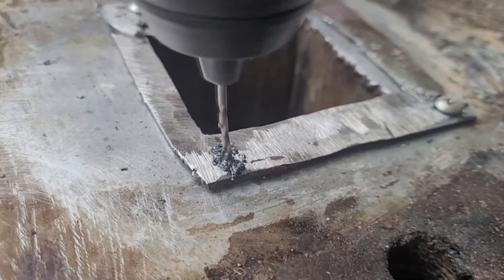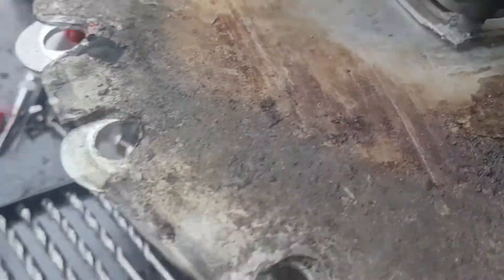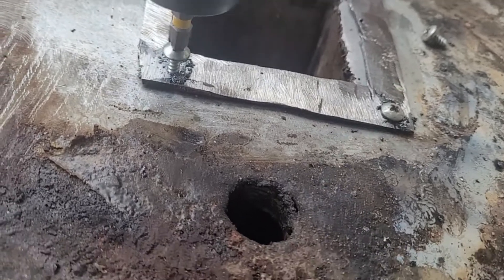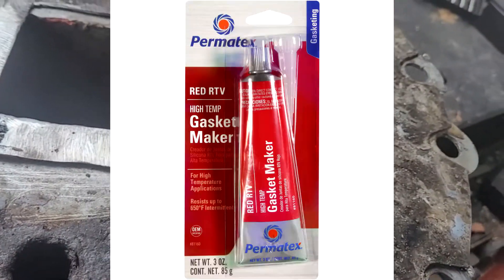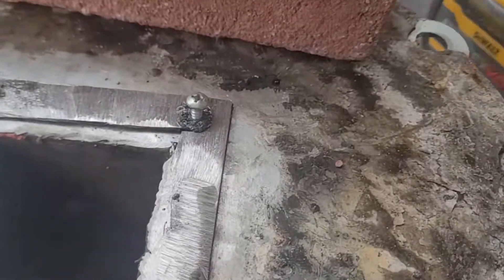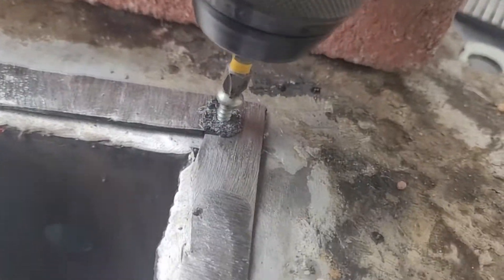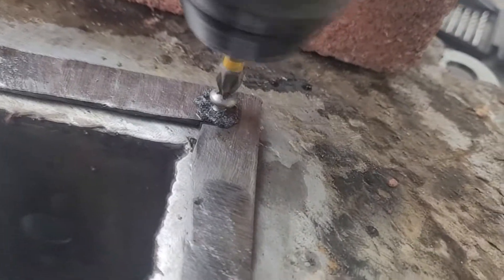The key is we need an adhesive material that is either microwave reflective or microwave transparent. I tested RTV silicone, which is microwave transparent, so it would never break off or flake under the microwave. But what would happen is it would peel off the waveguide sheet and come off, leaving a giant hole where gases would escape.